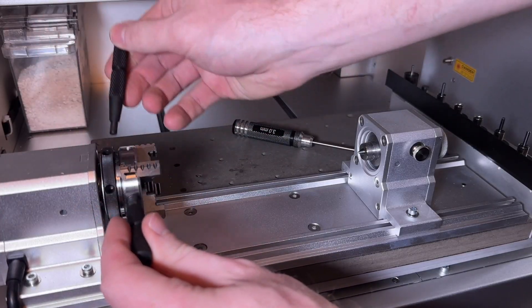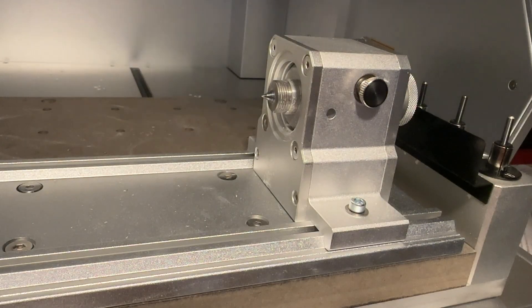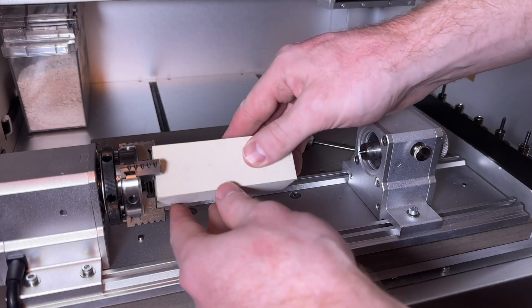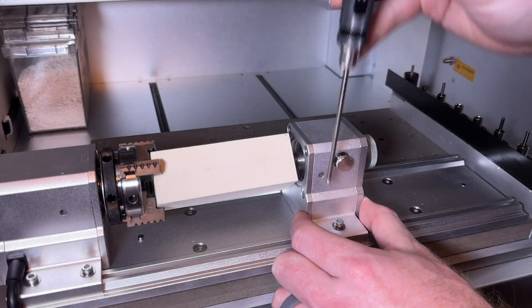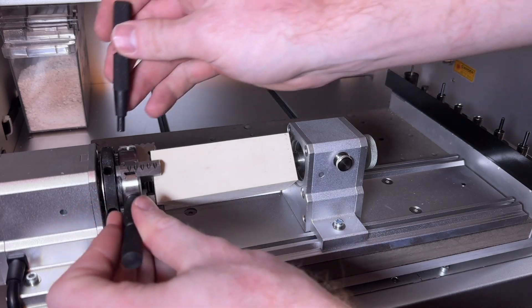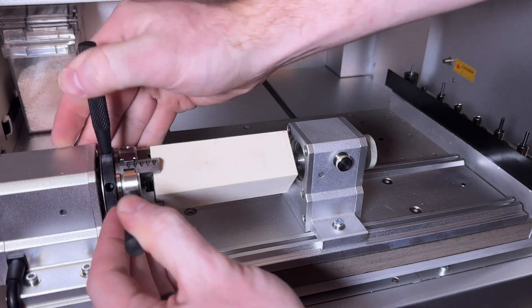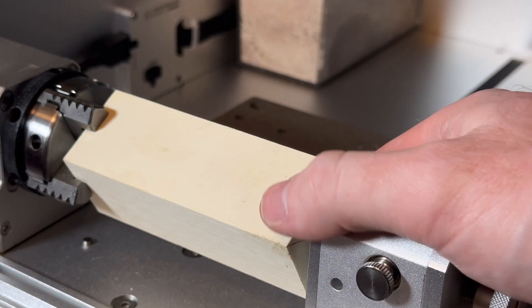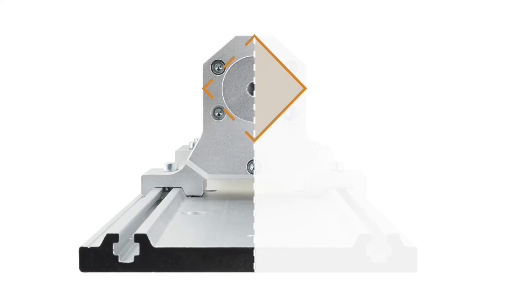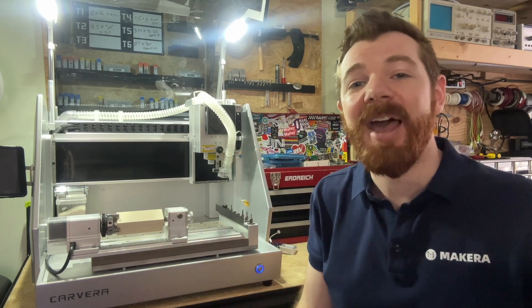To load stock, loosen the chuck using the two wrenches and loosen the set screws on the tailstock without removing them. Loosely place the part in the chuck, then slide the tailstock so it makes contact with the center hole drilled earlier. Tighten the two set screws for the rail of the tailstock so it cannot loosen. Then tighten the chuck jaws to hold the stock securely in the center. Rotate the knob of the tailstock to press and secure the material, then tighten the set screw at the top of the tailstock. Typically rotate the stock so the corner aligns with the vertical axis as shown in the examples guidebook.